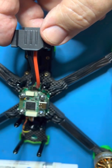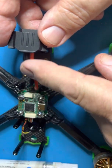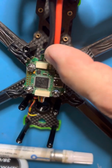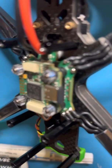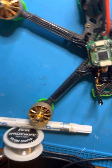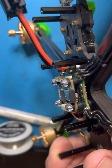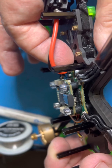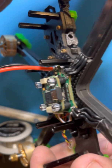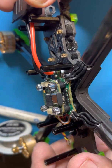Another thing: you will have to put this together with the sides and your Vista installed, and make sure the wires are exactly the correct length or it's not going to work. Something else that's important — do not solder those connectors straight down. If you do, it's going to hit up against the Vista. You're going to have to solder them pointing up. See how the connectors are up? Solder them up, and then they'll bend down very nicely over the top of the Vista.